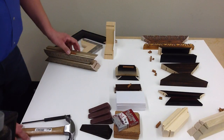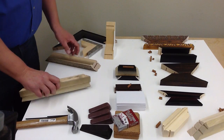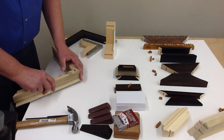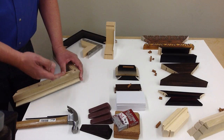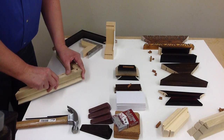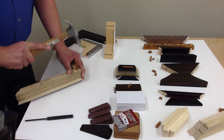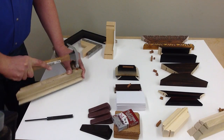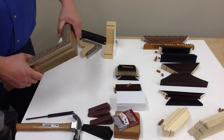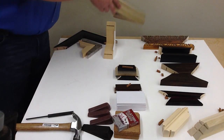Here I have something a little bit heavier still, with a nice ornate finish on top — fairly tall and thick. It does tend to fall over, but if you hold it with one hand while you insert the key you can still manage. We have the key here on the highest part of the molding. Apply some glue on both sides, set it together — the key is rounded on one end, which helps you get them started. There you go. Here is your frame, joint all the way up and all the way across.